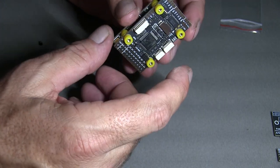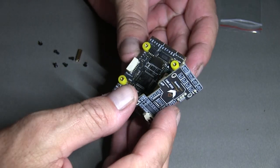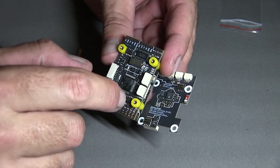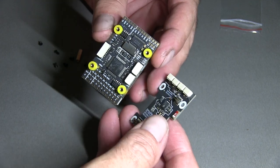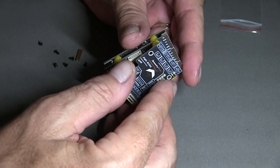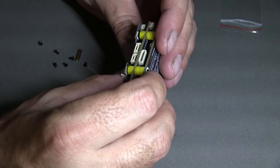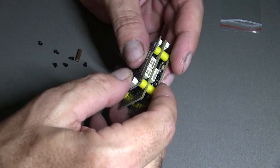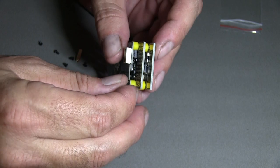I will be taking this all apart — like I said, I'm doing this just to get this flight controller set up with the firmware on it. Next will be the top board. There are also a couple of sockets here as well, and pins on the top board, so make sure you've got them going in properly — don't force it down because you don't want to bend pins. Be very careful doing these; this is probably a little bit trickier than the previous step. Your holes should all line up on your top board with your middle board, and then we'll screw all this together.